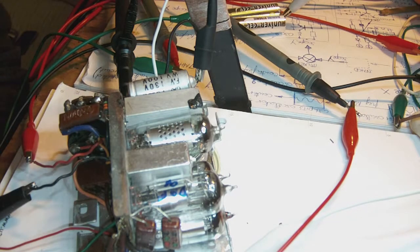Right. Well, we know a few things after having measured the oscillator circuit. Actually, it's quite positive. It means, one, that at least the high frequency oscillator tube, which is the 1R5, works. We know its filament works, obviously, and we also know the high voltage works. So that confirms, sort of, that my high voltage power supply seems to work okay, correctly, that is.